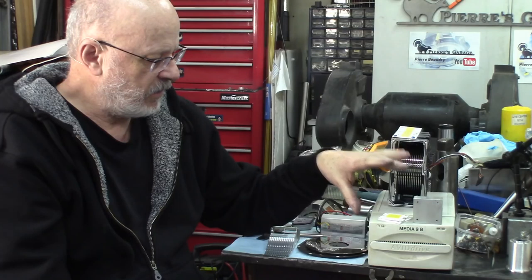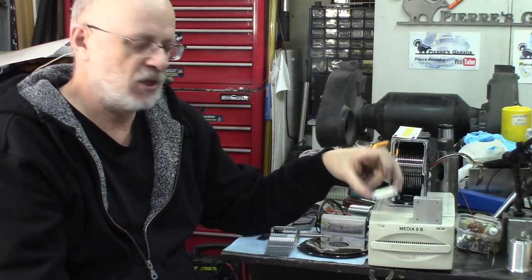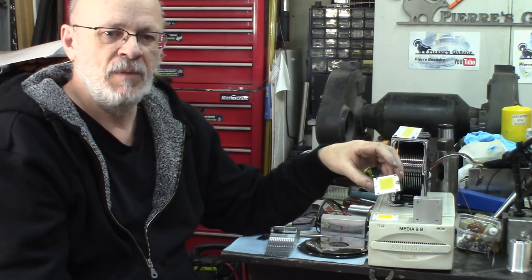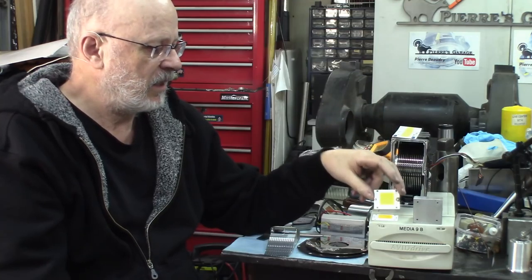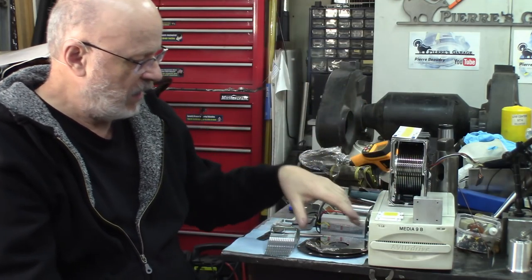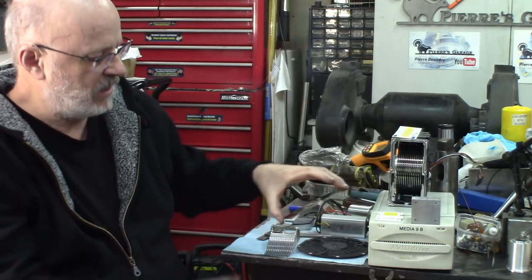Light cups — LED cups need to be cooled. You can't use them like just a normal light bulb. The thing is they won't last. If you overheat them, their service lifetime will be very, very diminished. So you need some compound or some way of dissipating the heat. We'll be building a few parts to achieve that.